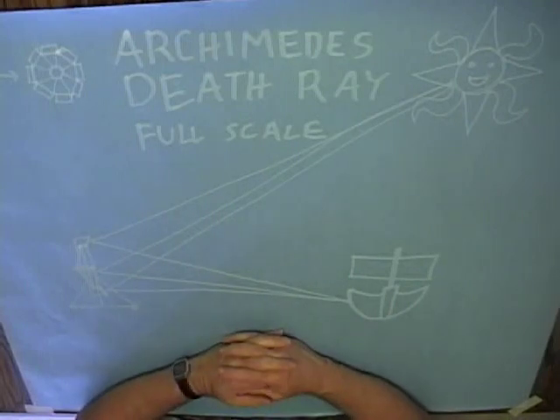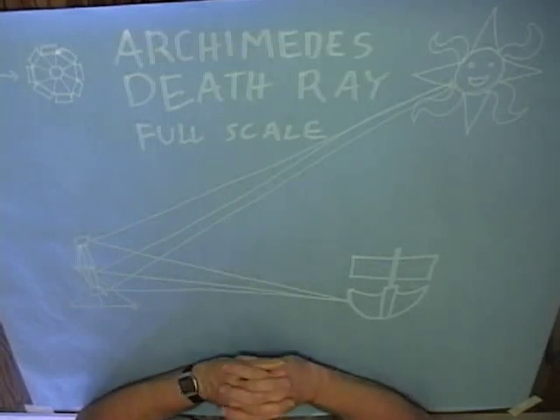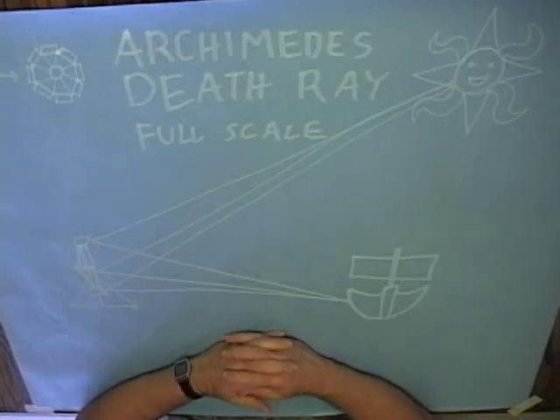Now since modern materials are much more expensive to use bronze in thick sheets than other materials, I'm going to try using plywood as a backing and sheet metal for the surface. On the assumption that Archimedes was a rather bright boy, I'm going to assume he also experimented with various metals to find which made the hottest burning glass, and would have discovered that the white metals work much better than the red ones. Since we know that tin plating predates the Roman era, he could easily have taken the bronze and dipped it in a vat of liquid tin, but there's also evidence that a silver wash technique was available around that time period, and that's what I'm going to use to improve the reflectivity of the metal. I will polish it up and then put a silver wash on it to get even more of the light.